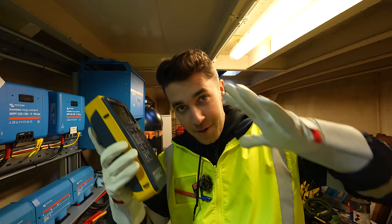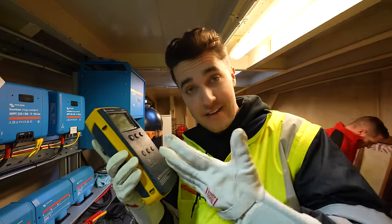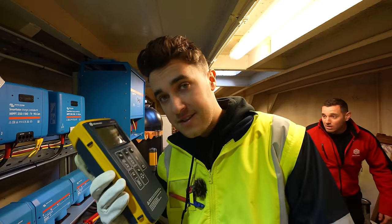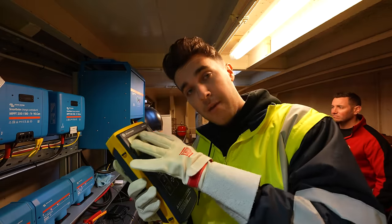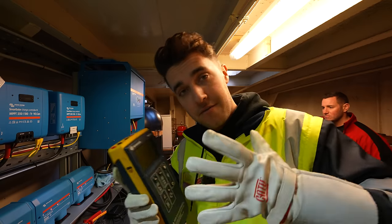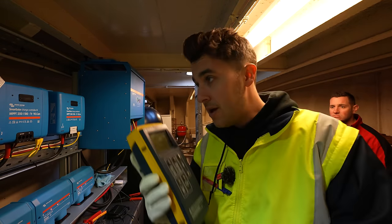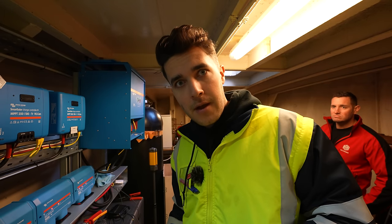With the tester I use now, the PV 150 plus auto test, it does everything for you. With all of the test results saved on here, that will be uploaded to my computer where it will automatically populate my DC test certificate for me to hand over to my customer. Incredibly easy, incredibly simple. So now we're tested — massive thank you to Chris from Seaward. We can move on to actually livening things up and commissioning.